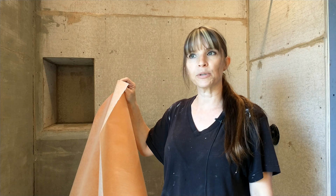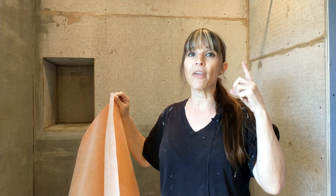So as you can see, I was applying the Schluter-KERDI system membrane to the interior of this shower. I've done it one time before upstairs in the bathroom that the kids share. And to be honest with you, I just wasn't digging it. I didn't like the system. I know it was an extra waterproof barrier, but there are these fibers on this side, fibers on that side. And those little fibers are holding up the weight of my tile. If those fibers don't grab on both sides — the side attached to the hardy backer and the side attached to the tile — your tile's falling off. So I didn't like it then.